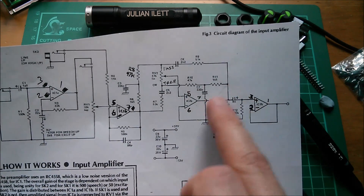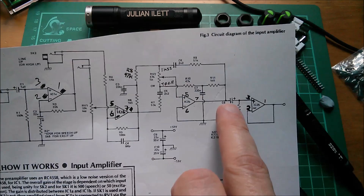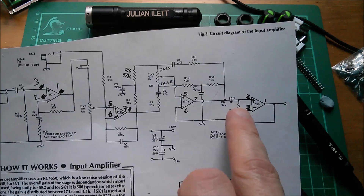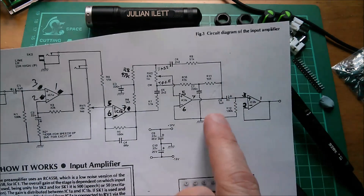There's about one volt here so it should be fine. You could actually put a bipolar capacitor in here, or a multi-layer ceramic which you can get in 1 microfarad — but then they are microphonic; if you tapped it you'd probably hear it.